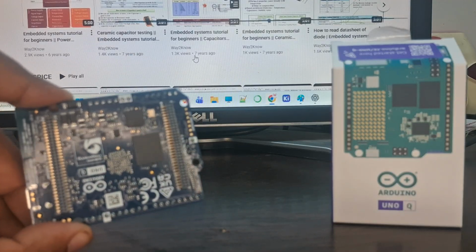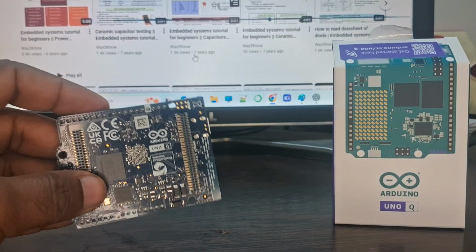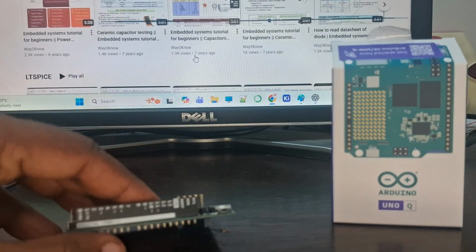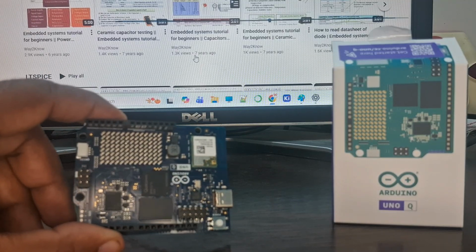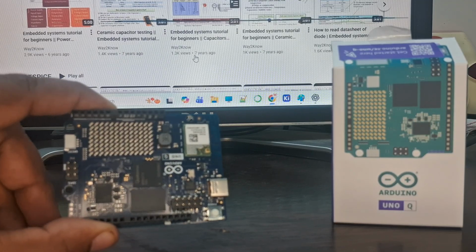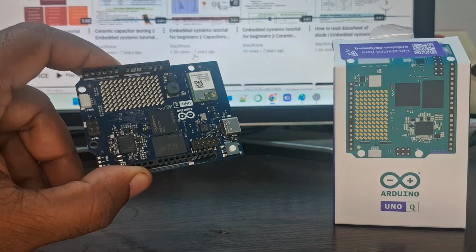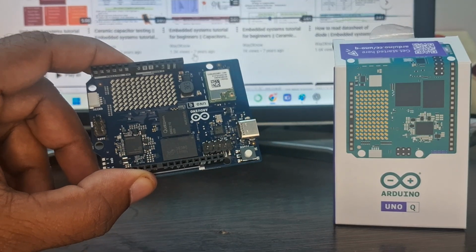we also talked about the eMMC support, right? And you see the board, the board looks awesome actually. The shine and the quality of the board look good. And you can also use any of the Arduino shields with this connector. The microcontroller pins or the generic interfaces like SPI, I2C, UART, GPIOs, all these are extended over these particular connectors, and any of the Arduino Uno shields that are there can be used with this particular board.